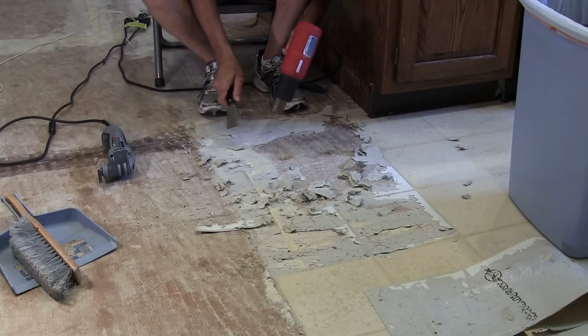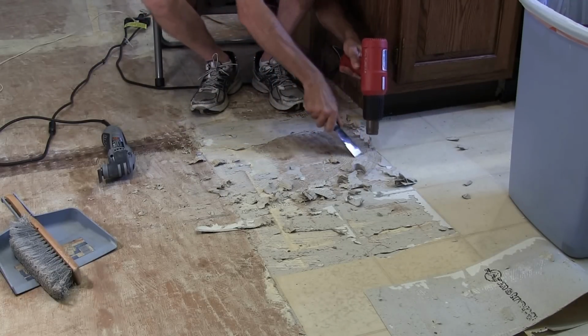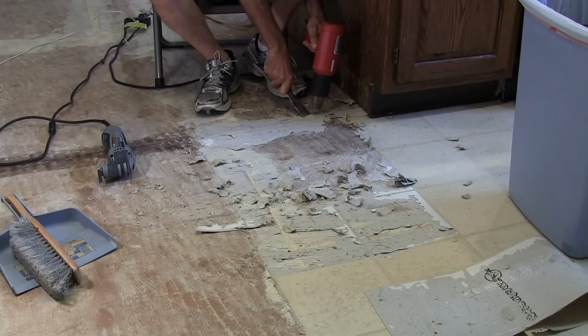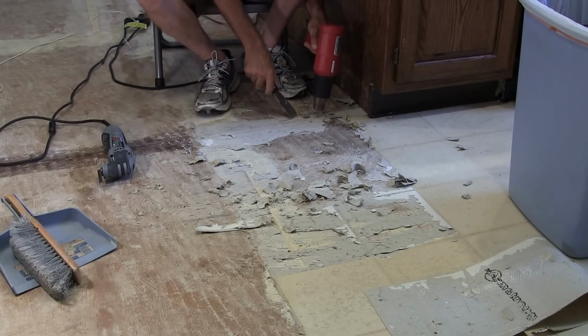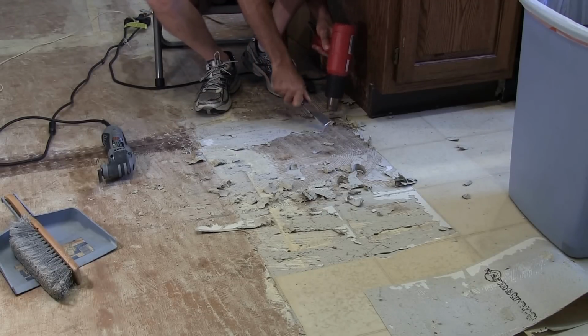Doing these 2 strips, that way I don't have to go too far left and right. And then go back to the left and work to the right again. Back on this seam glue, that is the slower part. Luckily, the seam glue is only, as it implies, at the seams of the linoleum, not seams of the plywood particularly.